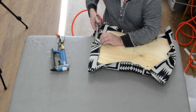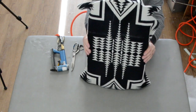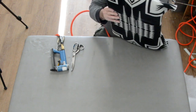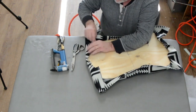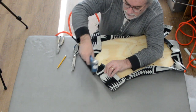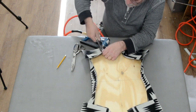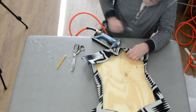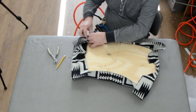I'm trying to make sure that I can see my top readily — look at how nice and balanced that is. So I'm going to do the same thing. As you increase your skill, you'll be able to just have that in your mind's eye: that's the beginning of the curve, you want to staple — beginning of the curve — stretching two ways, stretching this way and this way. I'm going to come back down here, take my pin staple out, stretch it, take my pin staple out, stretch it, staple. From the middle staple out to the bottom, to that curve point, I'm going to staple. I'm going to do the same thing up top.